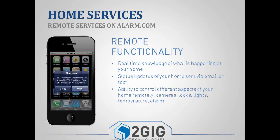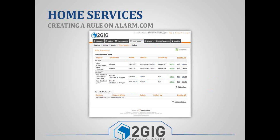If you're using alarm.com, you're able to go in and you can set all this up remotely, and that way the customer has the functionality and the ability to do that either through the internet on their computer, or they can control those devices with their cell phone. When you're creating a rule on alarm.com, you'll click on the Empower tab, and then there will be a rules section. And those rules are event triggered, but they also have separate details. So you can pick alarms, arming, disarming, sensor activity. For example, I have a rule set up at my house right now where if I walk down the stairs at night and set off my motion detector, it'll turn my living room lamp on. That way I can see.